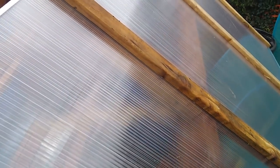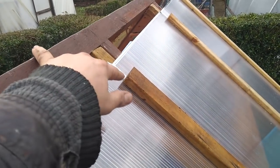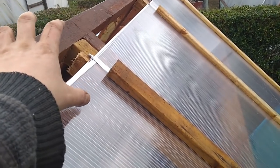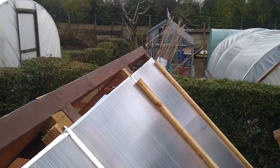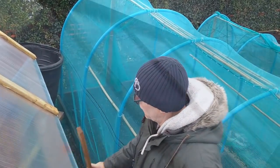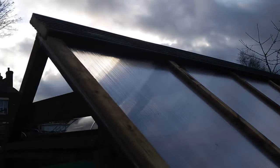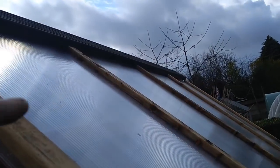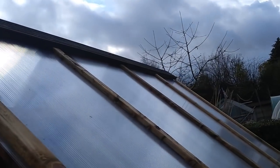And these are the 2x1s which are set at 5 inches. They're going to be down 5 inches from the top, so that when the ridge plank goes on, it'll fit flush with these. You'll see when we've done, won't they, Mick? Right. They will. Yep. So they're in, and the first of the ridge planks are in on that side. Now it wants screwing down at that end, as you can see in that corner there. It wants a bit of titivation and fixing off.